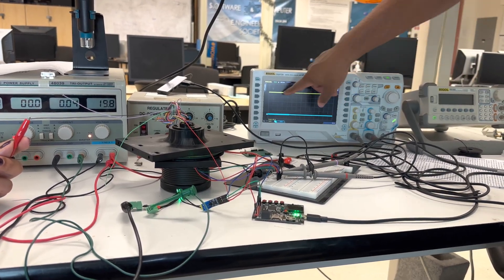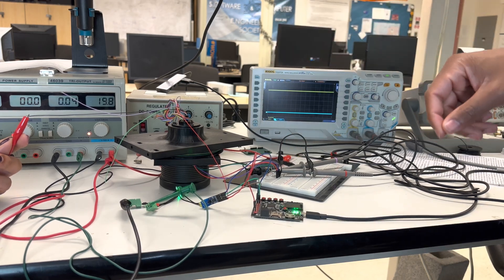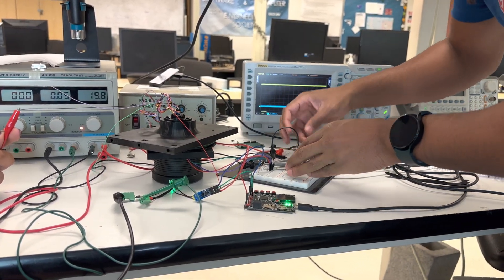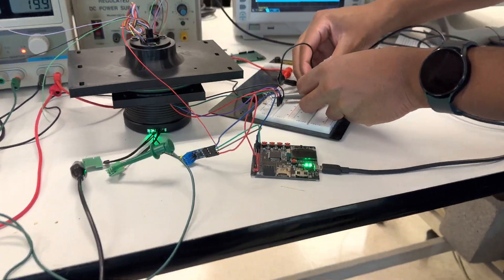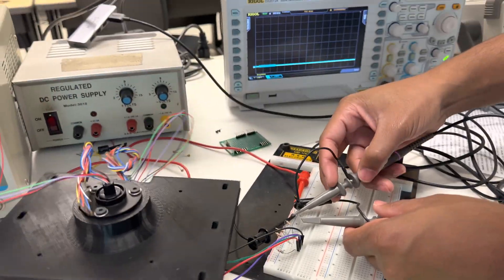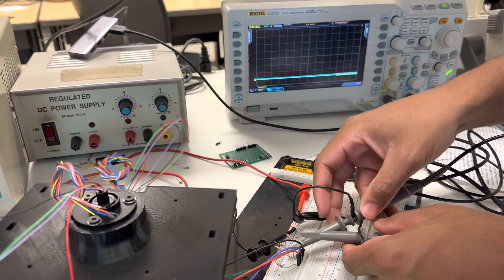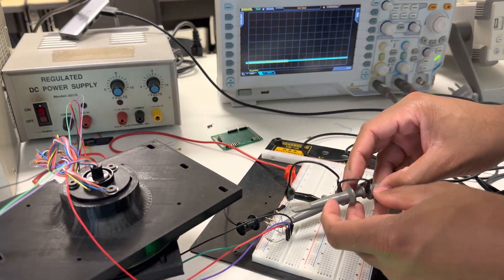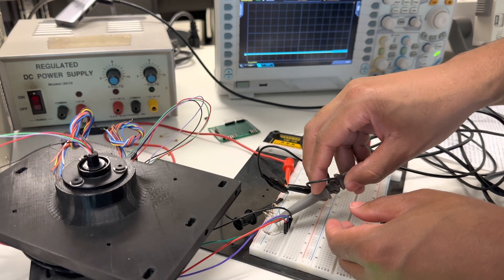As you can see, there were no weird spikes. There's a bit of a spike here, but I think that's from the thing stopping abruptly. So that looks good. I'm going to switch some of the connections — pink is now going to disconnect both of them, so you'll see some weirdness on the scope right now. I'm going to connect this side here, and then connect this over to one of the other lines to the left of it.